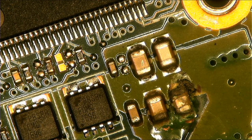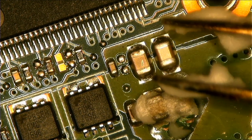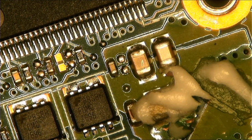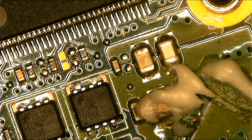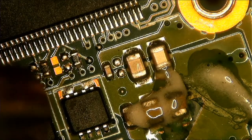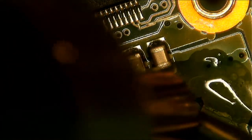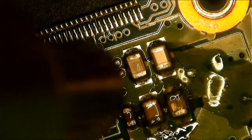Let's go ahead and remove this capacitor. After that we will check for a short again — we'll check those three capacitors and see if they are still showing a sign of being shorted. I remember when I was learning, this used to confuse me, because you'd find 10 or 20 capacitors acting as if they are shorted.